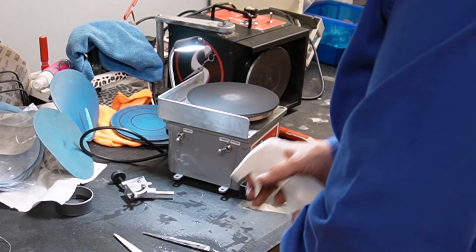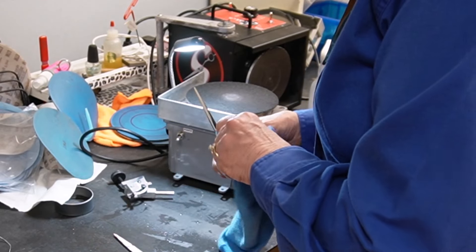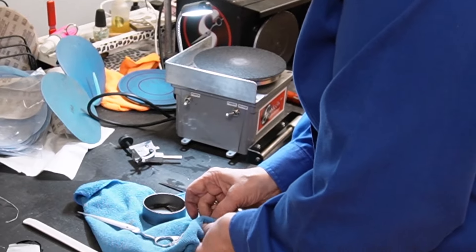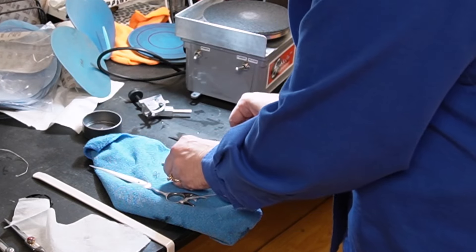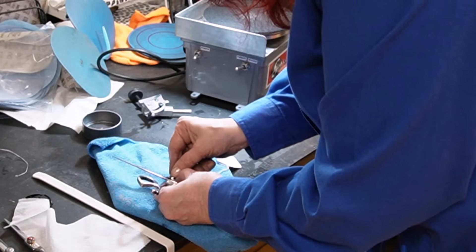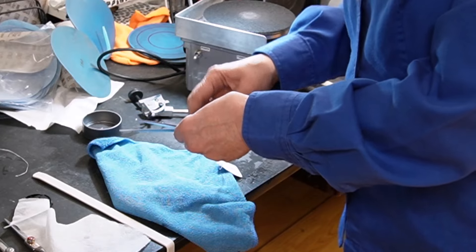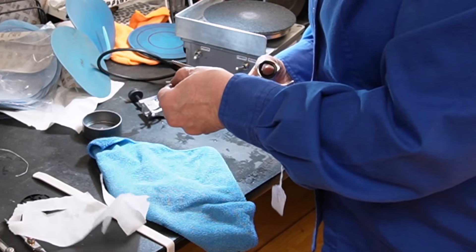All right, clean them up. As I go through I want them feeling nice and smooth and very, very sharp. You really don't want to do this on shears with inferior steel, because they just won't hold that sharp edge and your customers won't be happy when they go dull immediately. The little spring that comes underneath this leaf isn't something we normally stock, and these will have a slightly tighter-feeling adjustment because of that spring. I'm going to do a single-ply tissue test first, because there was a big old nick up here and I want to make sure it's gone.